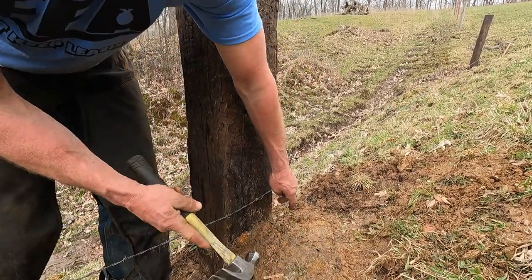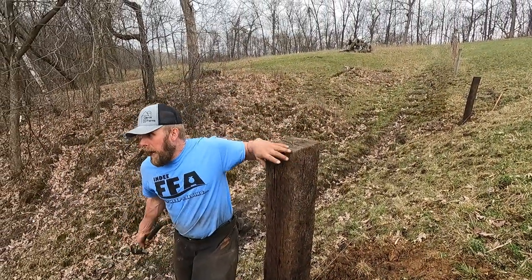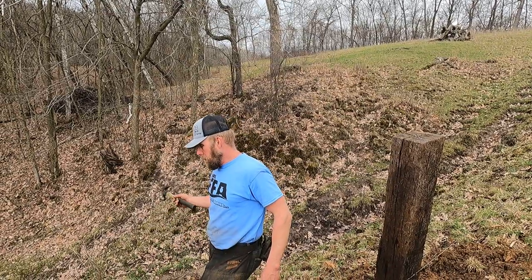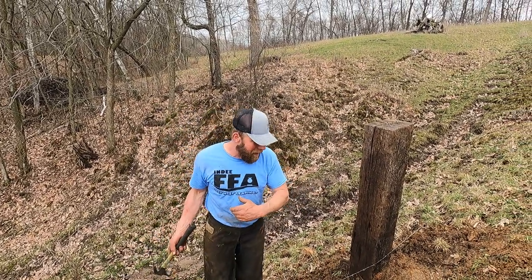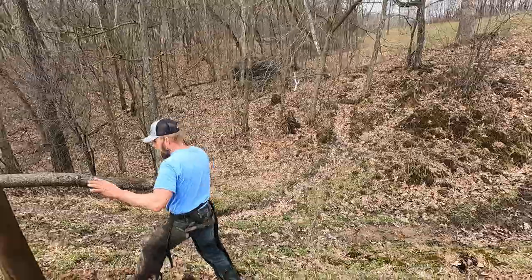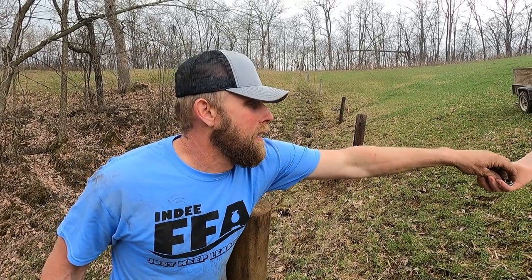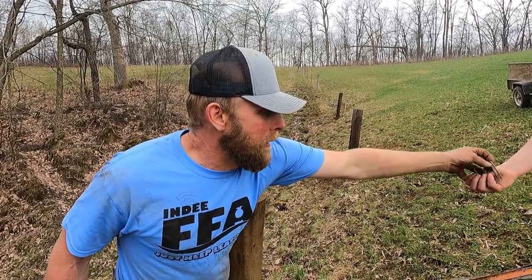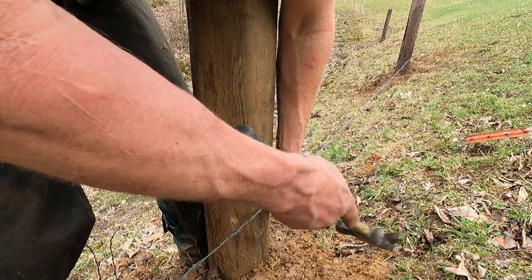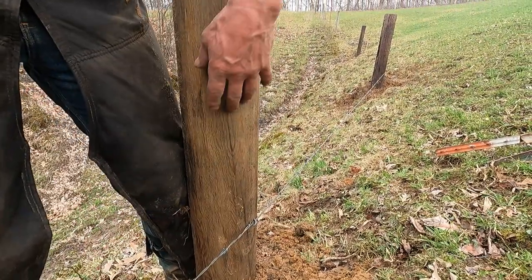And then the other thing is once we get all four on, sometimes you look at it and think it needs to be adjusted a little more. So now like here, okay, so the cattle on the lower side will be the ones we're trying to keep out of the field, because once they're in the field, they'll still have the spot on the outside. If there's no reason for them to go this way, they'll sooner want to go that way. So you have to look at the heights of the wires where the side that the cattle are mostly on. Sometimes you got cattle on both sides of the fence. So we're gonna go four barbs. And we've done five, heck, down by the buildings where the calf pasture we put netting in. And it's all to keep these cattle where you want them to be. And it just makes farming a lot more fun when everything is kind of working according to plan.